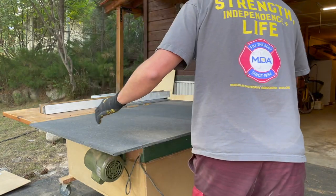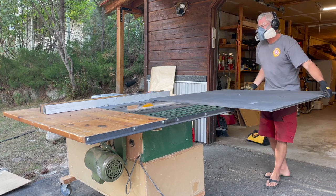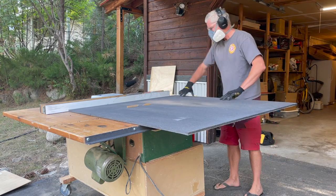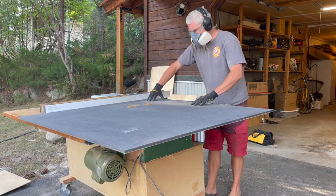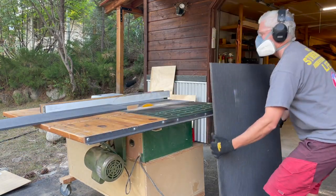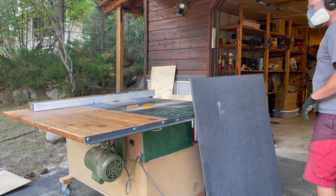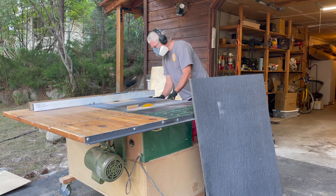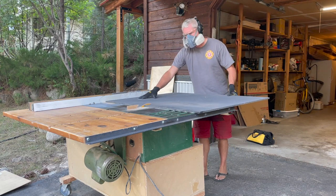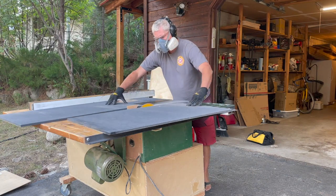As far as cutting these boards, you can use any standard tools — they cut easily on table saws, drills, everything. They're really nice to work with. The big benefit is that they are waterproof — there's no natural product or wood in them, so if they get wet, you won't damage anything. They take paint and primer well; for example, you could build a shower out of these panels and just throw on some primer and a coat of paint. The disadvantage is they're a bit more costly — about twice as much as plywood.